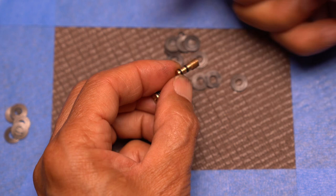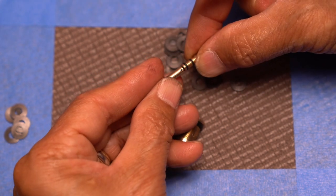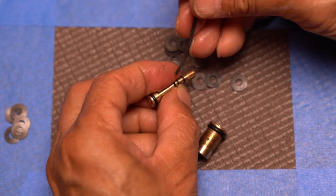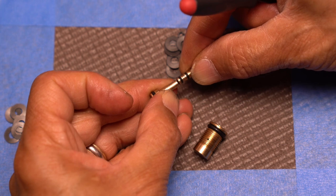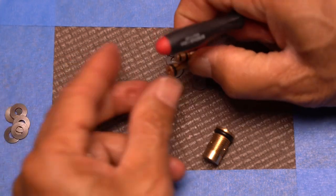It would cause a creep. It would leak out of here and it's partially shut. What it would do is this little small area here will get pressurized and kind of open the rig piston open, then it will cause a creep. You'll see the rig gauge will go up.